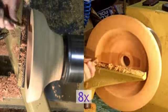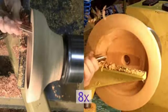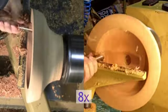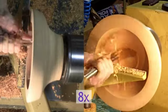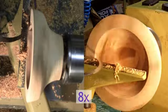After a week, it's down another 10% of moisture loss, so that's a total of 21%. I'm thinking it has at least 30% moisture content that I need to drive out. So it's not enough. At this point, I'm not going to microwave it anymore. I'll just let it dry in the sack, and then I'll have to address the checks and see if I can get something salvageable out of this bowl once it is really dry.